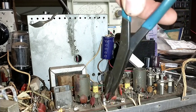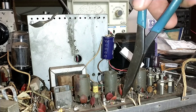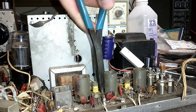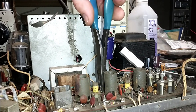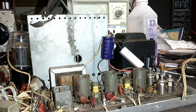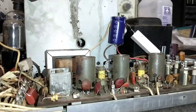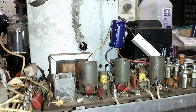I'm keeping the wires in place because there's not a whole other lot of places they can go. That one's soldered — and this is also a hold-down for the board, so we'll have to make note of that. It's basically going to be like the main board: replacing the tube sockets and any out-of-tolerance resistors. They're all ceramic caps here, so we don't have to worry about drifty paper or wax caps.